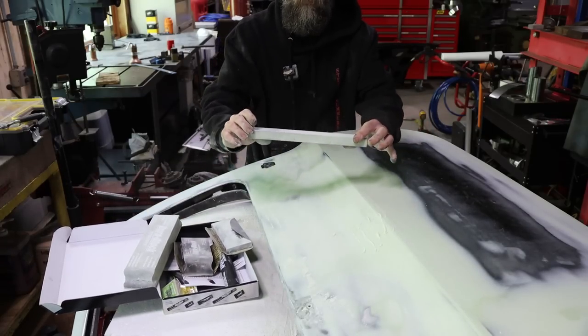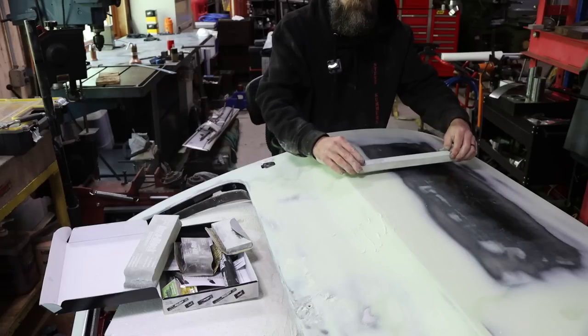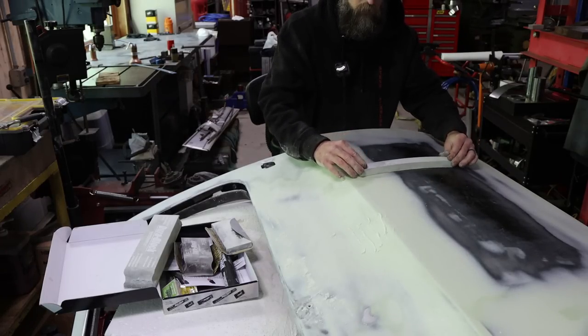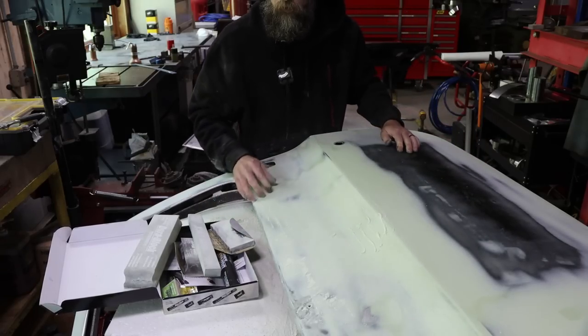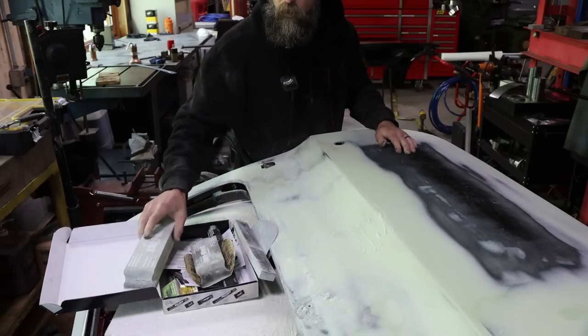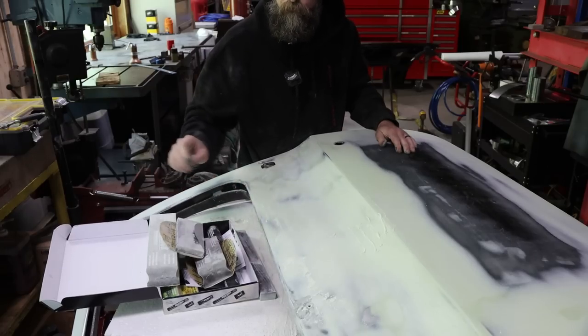And this kit, not a sponsor or anything, came with all kinds of different profiles and shapes, like this block here. Really nice because it's got some flexibility to it, because this door is not flat, right? So you can take that block and contour it to the shape and sand that, get you a really, really nice surface, and then some thinner ones, some shorter flat blocks, and then your long flat surface block. So, really nice kit.